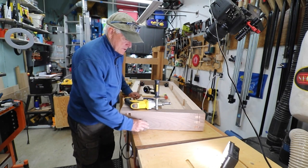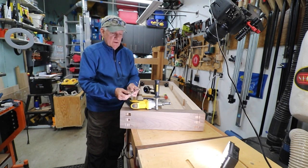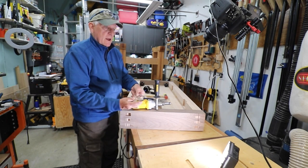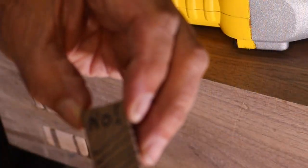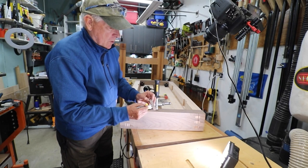When it comes to doing wedge tenons and spiking them with your wedges, there's a wrong way to cut them — and I experienced that. What I did was cut my wedges cross-grain, and that's wrong.